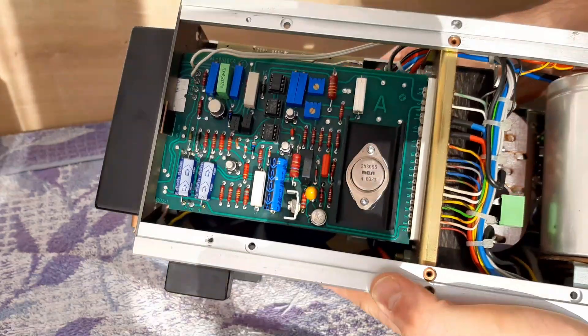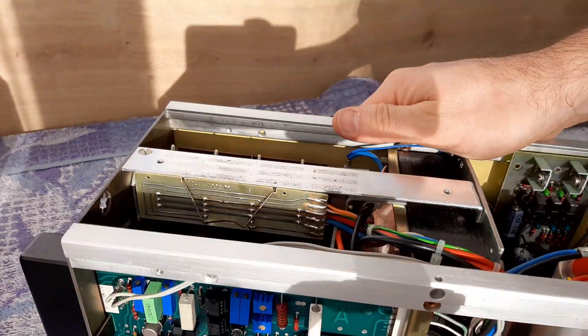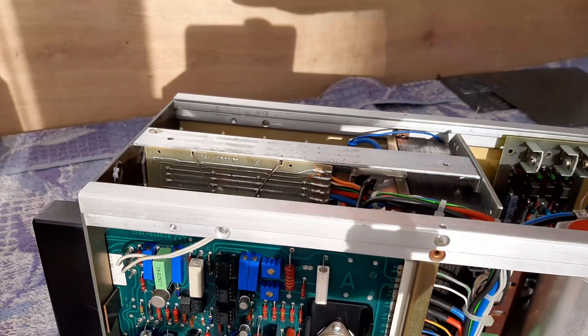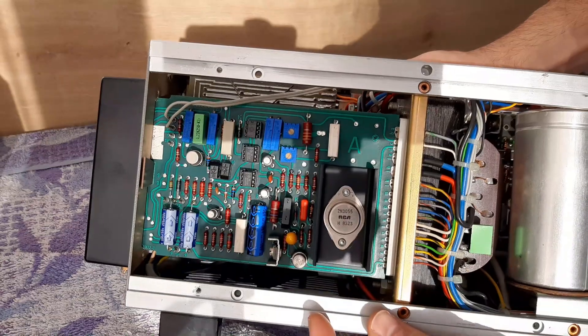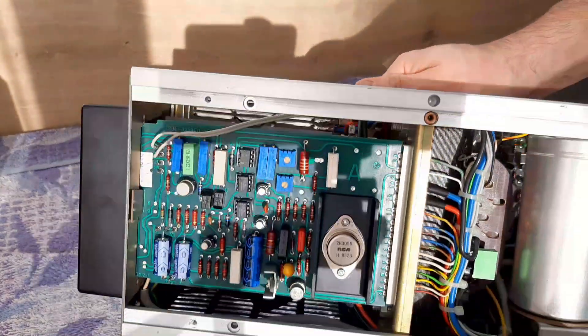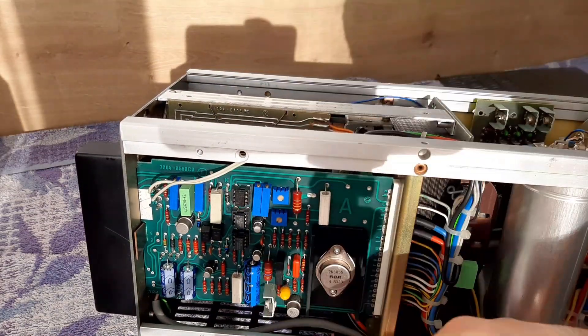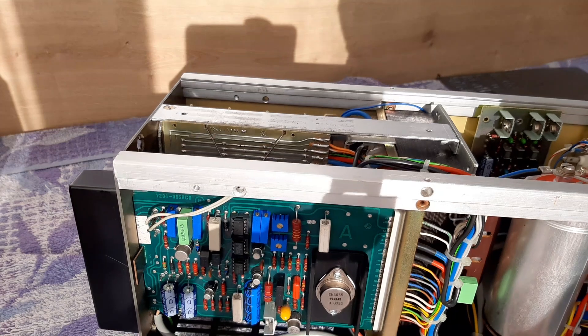There is a fan — it's temperature controlled. It creates an airflow between the heat sinks of the transistors, pulling cool air down past the transistors and the driver. You can see the structure of this heat sink. The air comes in from the front of the board and cools both sets of components. Let's make a test.